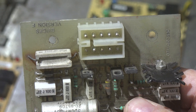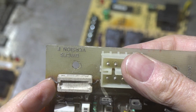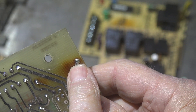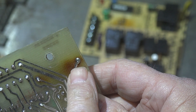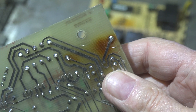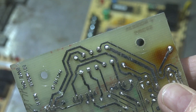The only thing I've occasionally seen happen with these resistors is that if the wire gets hot enough to melt the solder, sometimes you'll see what's called a halo — the solder just kind of drips out, leaving a hole in the board where the wire isn't really soldered to anything. That can sometimes happen. But generally, burn spots are not a real indicator of whether the board is good or bad.